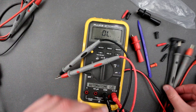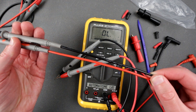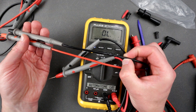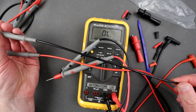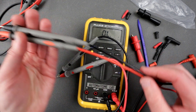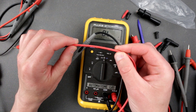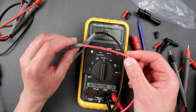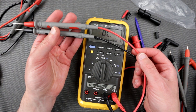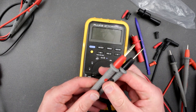This cable is PVC rated 105 degrees and 1000V, but this other wire has no markings whatsoever. Honestly, it feels essentially the same. Who cares about the outer diameter of the wire? What I care about is the AWG — the thickness of the conductors inside. You can just measure the OD with calipers — listing OD is so lame.